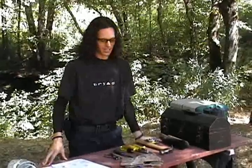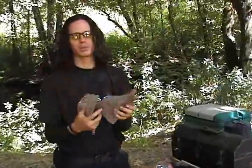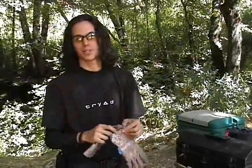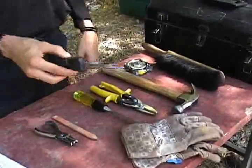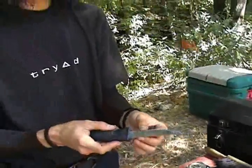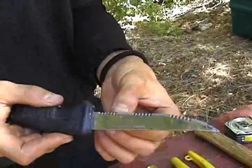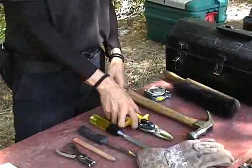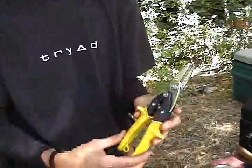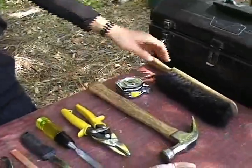Now let's talk about what tools you need. First of all, most importantly, you're going to need a set of gloves — some kind of leather gloves, something to protect your hands because we're going to be cutting steel. It's very sharp and very dangerous; I've cut myself a number of times. You're going to need a pencil, a serrated knife — I like ones with very tight serrated edges because they cut through tin much easier. You're going to need a chisel to start your holes, tin snips or metal cutters, a hammer, and a brush to clean up with.